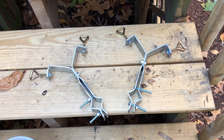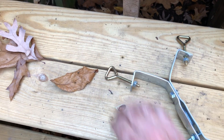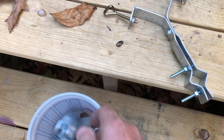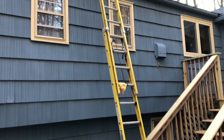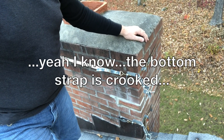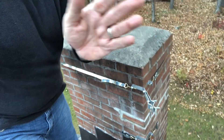Here are the components. It's these two brackets, and I've already pre-assembled some of it — I put these strap bolts on already. I also put in the bolts that'll hold the mast on, and these metal straps that go around the chimney. The bracket is up, it's relatively sturdy. It takes a lot of work to get all the slack out of those straps, so if you ever use one of these, be prepared. You may also want to wear some work gloves.